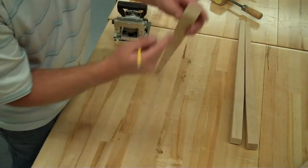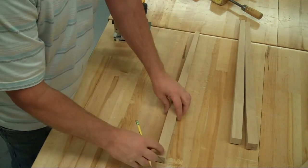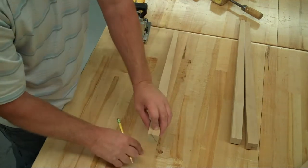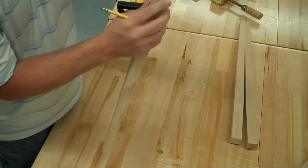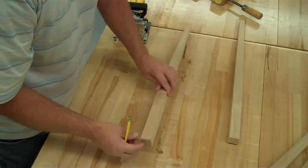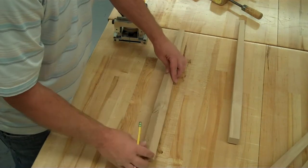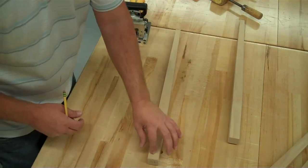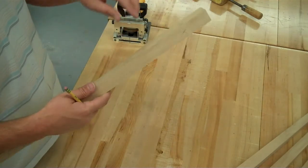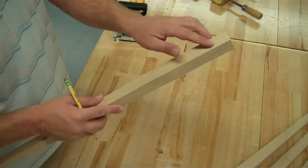Just check all your boards on your legs. Rocking — so we know the face touching the table is tapered. Rotate it — that face is also rocking. The other faces do not rock. Mark the sides touching the table with an X. So there are the two tapered edges on that one. Check quickly on all your boards — mark the side touching the bench. That rocks, that rocks, does not rock, does not rock — marking those with an X. Quickly find the tapered edges because we're going to cut the same biscuit slot on your legs where the X's are.